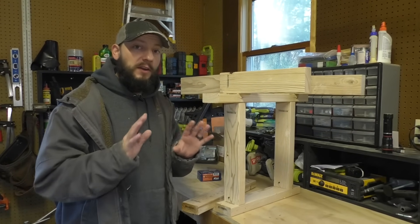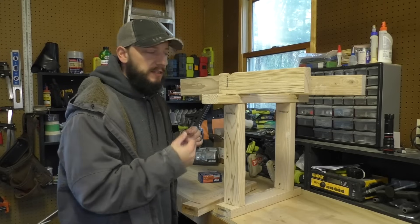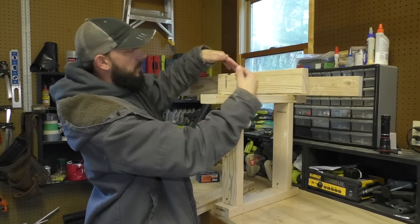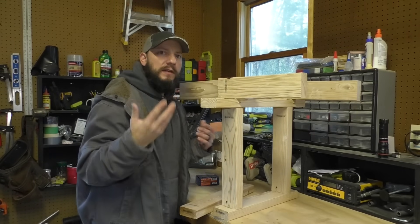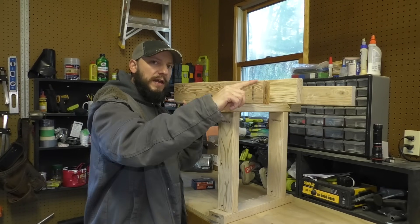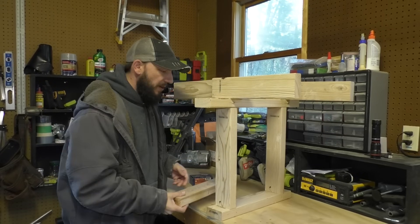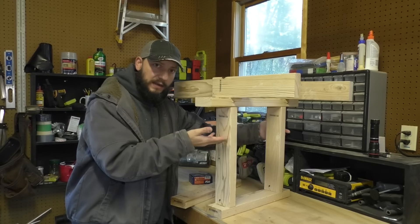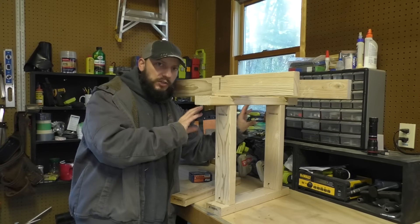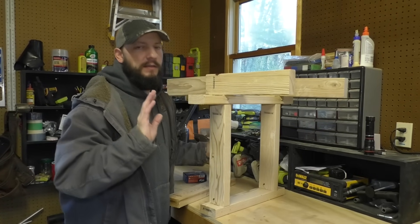So that is the first thing you need to understand about cutting a hole in a load-bearing wall — it needs to be supported properly. I've made this little mock-up to go into a little more detail, and this is just very important. First, identifying if you have a load-bearing wall or not. In most cases, if you open up the ceiling, you'll see that the ceiling joist or floor joist will overlap right here and they're attached. Sometimes they just butt together in older houses, and sometimes you could still have a load-bearing wall even if the ceiling joist goes all the way across, because it could be undersized and you actually need that wall so it doesn't sag.